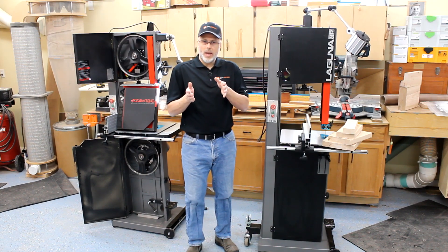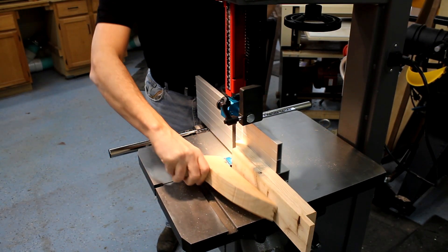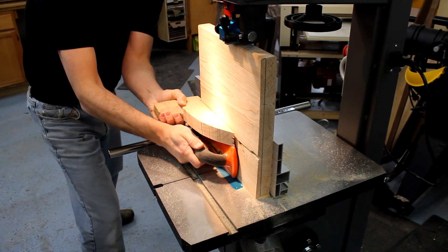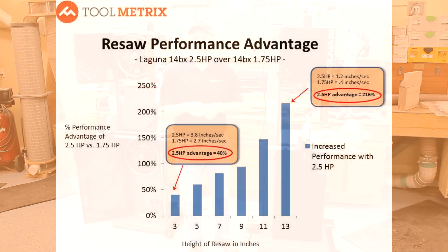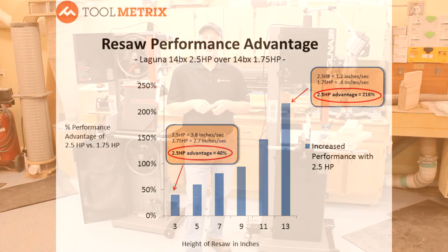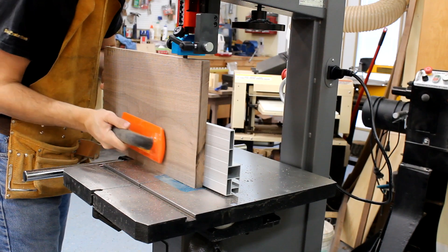What we found was that at the smaller sizes, the saws were roughly equivalent in their ability to cut through at a defined rate. As the size increased and more load was applied to each saw, we saw the two and a half horse gaining in its advantage over the one and three quarter horse. You can see by this performance curve that once you get up to the eleven and thirteen inch sizes, the difference is pretty pronounced. These were all construction lumber for ease of testing. We then maxed it out with a thirteen inch cut on a walnut plank, where we ran at about two and a half times the throughput on the two and a half horse saw.